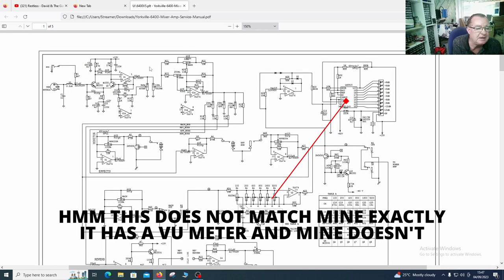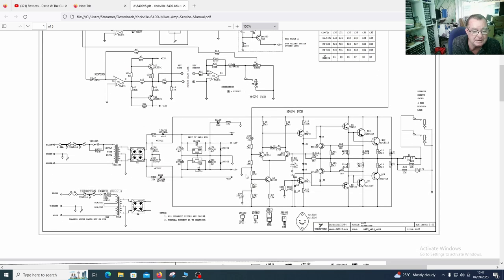So we can see here, this is the power supply part. I found the power supply section here. What do we have? We have a plus and minus 45 volts. That is what we found. That's where the large 4,700 microfarad, 63 volt capacitors are, the two large electrolytics. Those are the ones I couldn't actually read the value of in situ, but I didn't find any ripple on these.